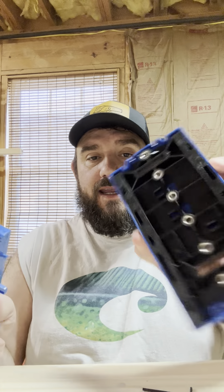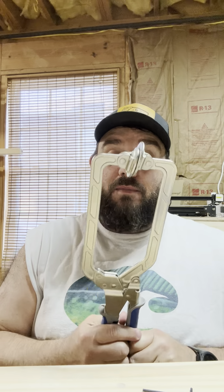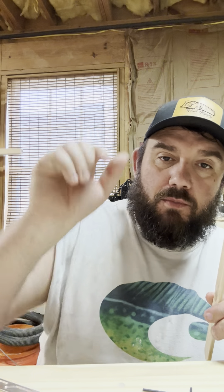Right now I don't have a face frame on this area where I'm putting in adjustable shelves, so I'm going to use this guide. It's very easy — you have notches here, just line the notch up, slide it in, and you're ready to go. A couple of other things I like to use: I've done three rows of these shelf pins, a clamp of some kind — this is the Kreg auto clamp — a squeeze clamp, and a spacer. This one is about eight inches because that's where I want my first shelf to go.